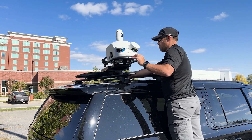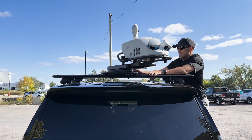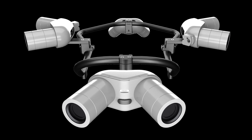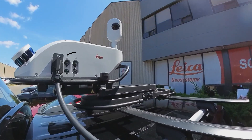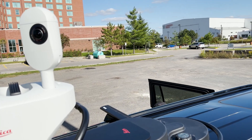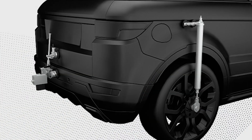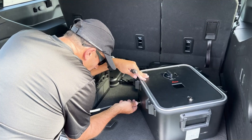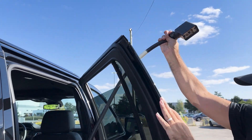If you wish, you can turn and lock the sled at a 30-degree angle to the left or right, depending on your scanning requirements. Next, if you're using the optional butterfly cameras, snap them into place and connect their cables to their proper ports on the scanner. Anchor to your vehicle any other accessories you plan to use, such as the optional additional GNSS antenna and DMI. Place the control unit and battery unit inside your vehicle and securely connect them using the push connectors, then crack the window and connect the control unit to the scanner.